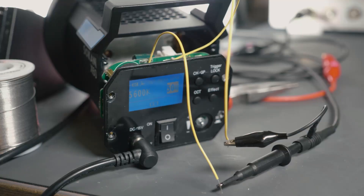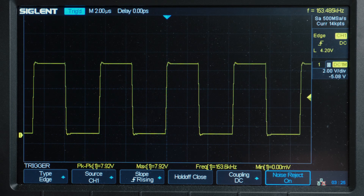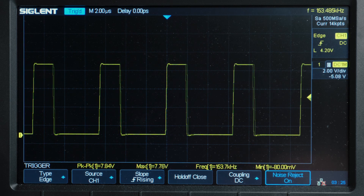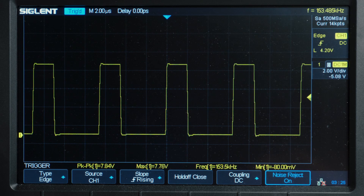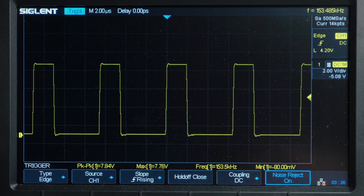Checking out the actual PWM signal from the controller, I had to bodge in a couple of wires so I could probe this thing properly on the oscilloscope. When I put it up on the oscilloscope, at 50% you can clearly see a 50% PWM cycle. As I lower that down, the signal narrows — it looks like it goes down to around a 30% PWM cycle. When I ramp towards full power, it doesn't really go much beyond about 50%, and as I get really close to 100%, it flips into a slightly different wave configuration where it's on a little bit longer but changes the way it cycles so there's not too much power during one cycle. That's one of the niceties of using a prefab PWM controller — it takes into account little adjustments for the passive components that you'd have to figure out yourself if driving this with just a microcontroller.